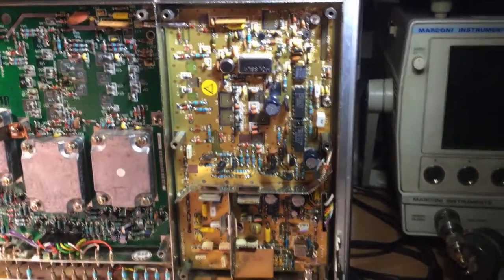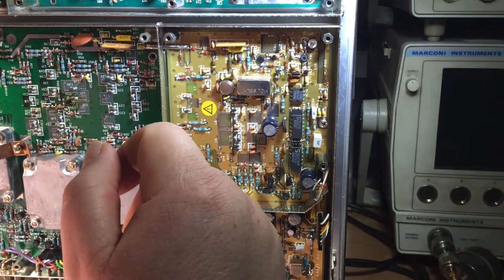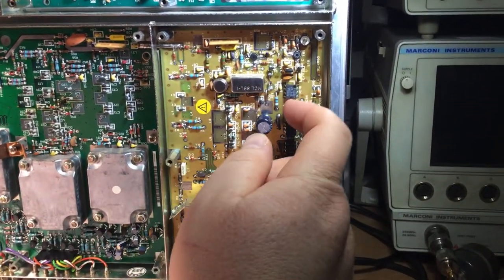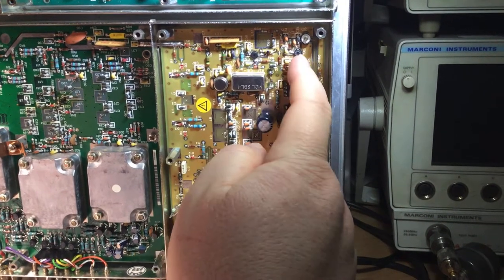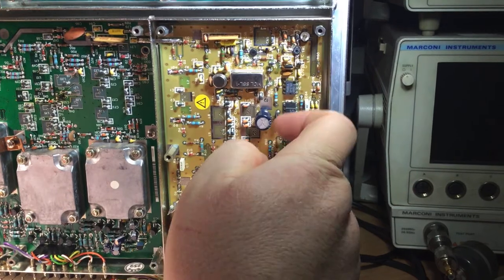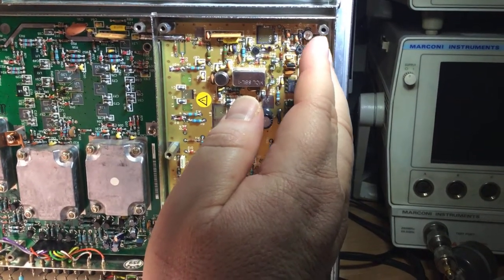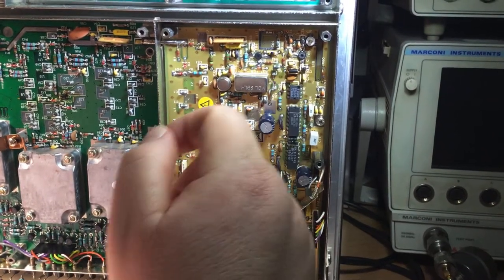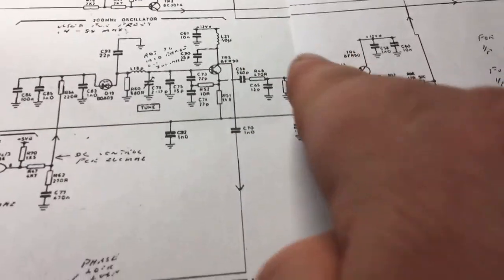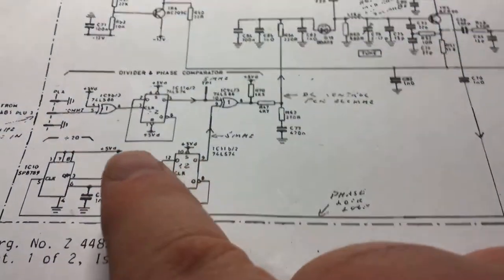The issue I've found is that the fixed 200 MHz oscillator isn't running at all. So it can't mix the incoming signal to give a low frequency output below 80 MHz. These two transistors form the main oscillator, with a varactor diode and buffer amp which feeds the 200 MHz signal to the mixer. We have a tuning capacitor C79 which chooses the center locking frequency of the oscillator, and no matter what you do with it, the oscillator won't run.